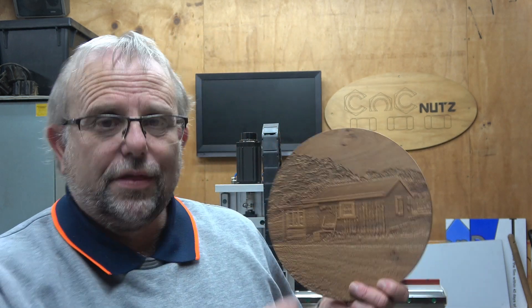I've got a bit of a disaster. I was having a play around with 3D models — this isn't a true 3D model, just a quick and dirty rendition — and I wanted to try overlaying laser engravings over the top. I engraved it and it looked pretty good, but then I cut it out and put the varnish on. The engraving was so light that when I brushed the varnish on, I also brushed away all my dots. The dots were obviously little bits of carbon that had sat on the surface of the material.